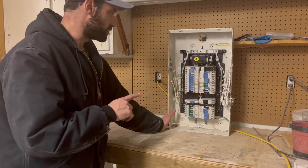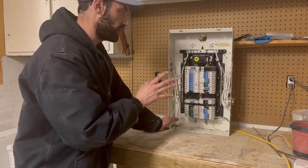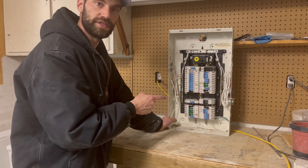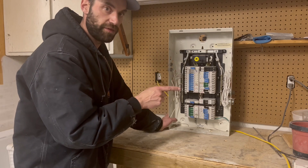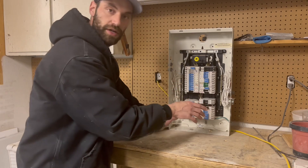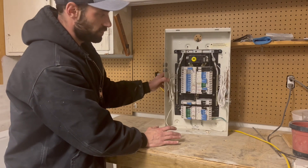Hey guys, it's Dave here. I was just stripping down this panel and I thought I'd do a quick video. I've had questions before on how to put breakers in, and on this Federal panel there is something I'm going to show you where you could mess up and get 120 off the same phase and just not split them to get your 240 off a two-pole breaker. So I'm going to quickly explain some stuff that's inside of this panel so we're not confusing anyone.